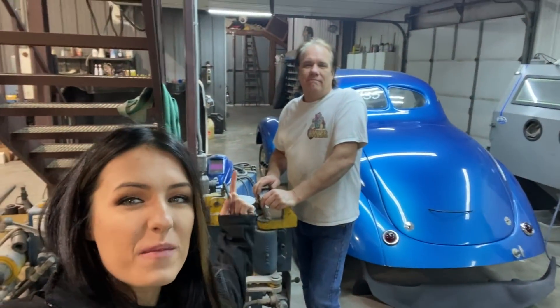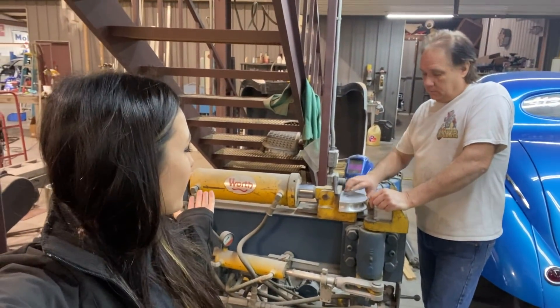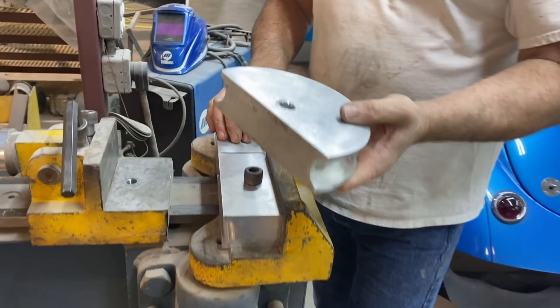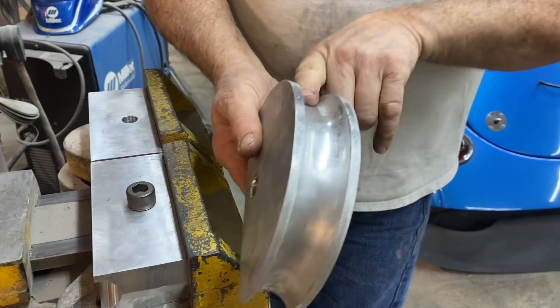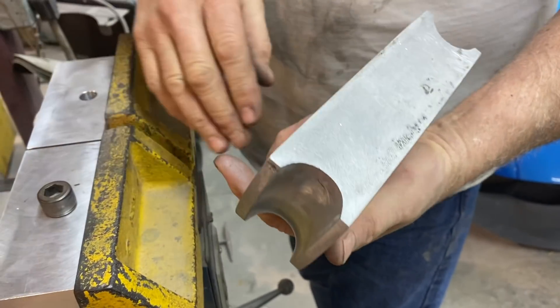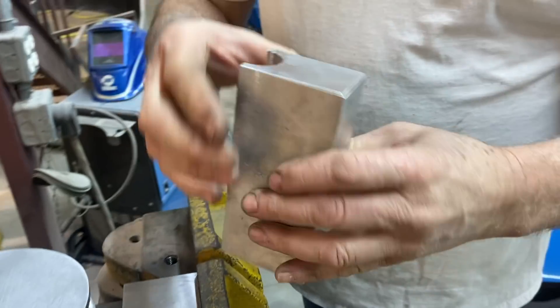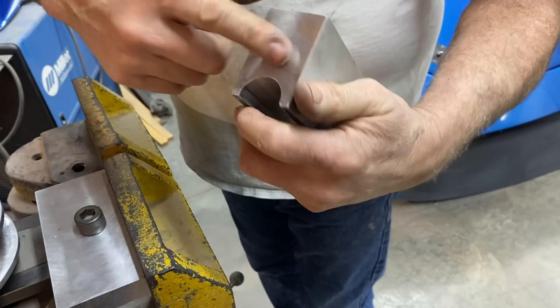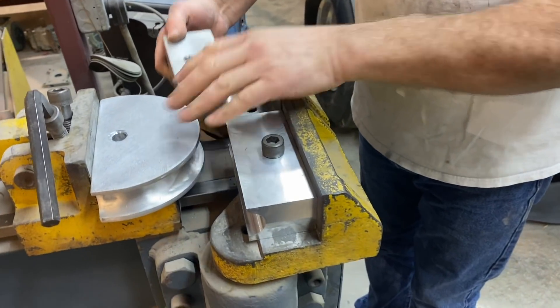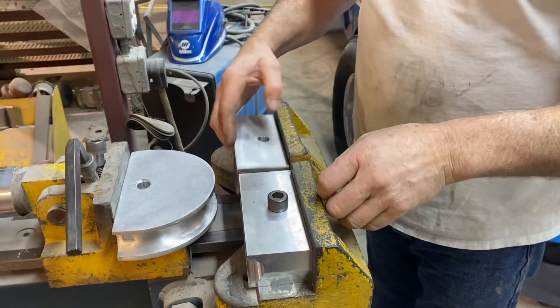If it was something we were doing more often, this would be reasonable to do, but right now it's just taking more time on something that could just be done. Came in this morning and he got them all finished up. He's got them out now so I can show you. It's pretty successful. That's the piece we cast — I just sanded it with the little hand belt sander, sanded that side and smoothed that side off. That one seems to be good, might bolt in there. These are just a couple blocks of billet that I machined all six sides to match the thickness of that, then machined a groove in it. They're ready to go. Time to make a bend.